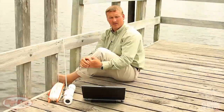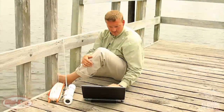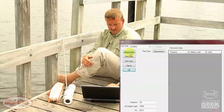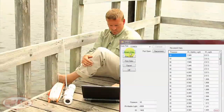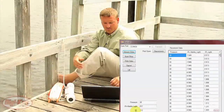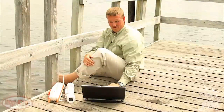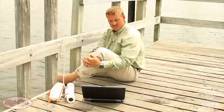We'll record to EEPROM and pull the data out later. Choosing our COM port on the GUI and connecting — port open, so we're good to go. We'll stream data, and when I pass my hand over the sensor you can see the light data reduce and then replenish itself as the ambient light is detected again.